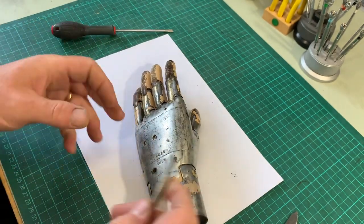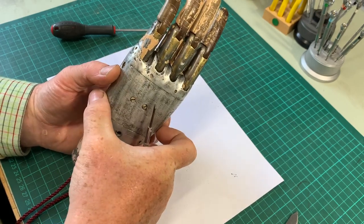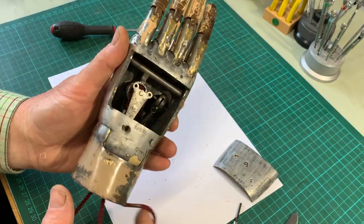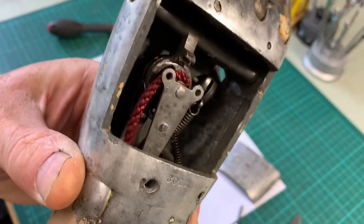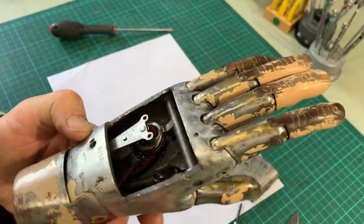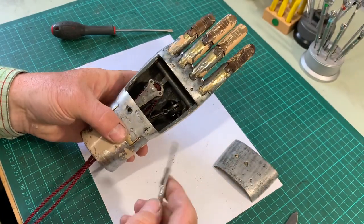The action is fast and very mechanical in sound. The casting is very precisely made — the fits are excellent, similar to a clock or watch. The cord goes round a spiral cut steel disc called the worm, and it operates the tiny rack you can see moving up and down, the movement of which is amplified to make the fingers open and close. The thumb is spring loaded in both directions to enable it to grasp objects of different diameters.